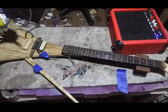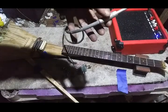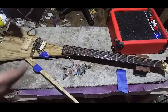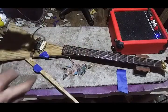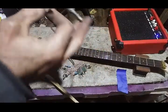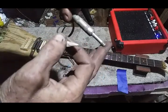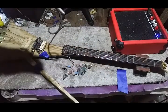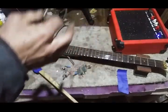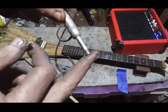So let's see what I can do about all that buzz and hum. Starting with, I got a real cable here, so that might help. That cheap cable was actually a source of hum I discovered, because I had the amp - like you hear right now, it's on and up, but it was this quiet without that other cord plugged in. But as soon as you plugged in the cord, you started to get at least that level, if not higher.